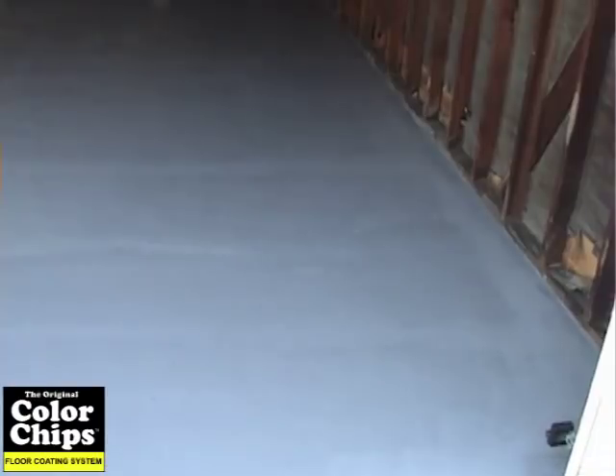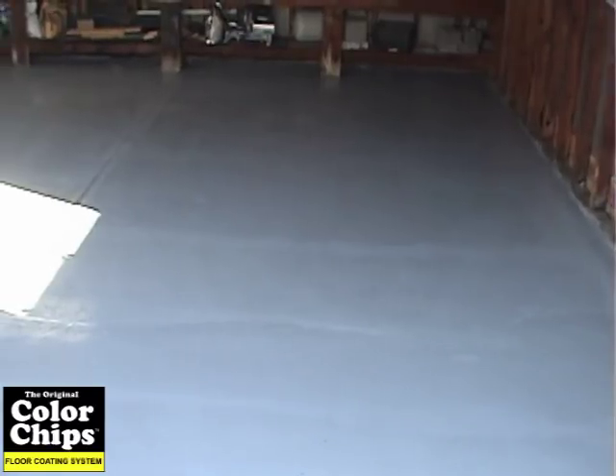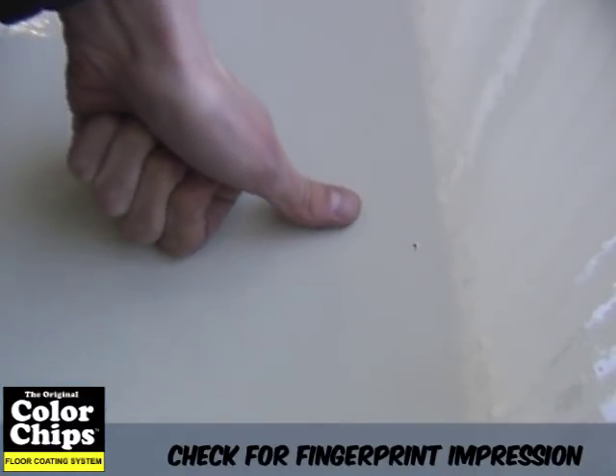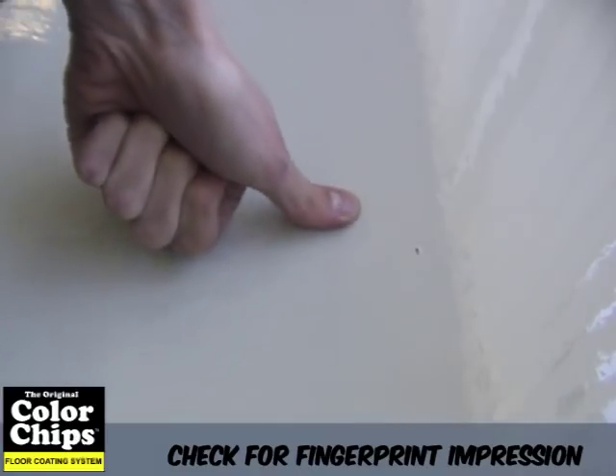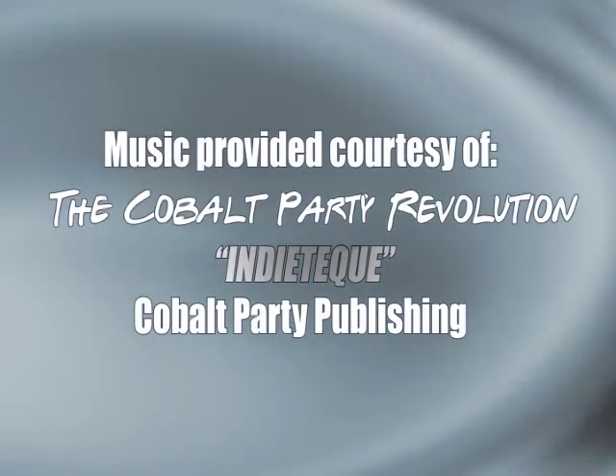After applying the primer coat, you may notice blotchiness. This is normal as the coating soaks into the substrate at varying thickness. You must be sure that all of the water or solvents have evaporated from the previous coat before applying your next coat. You can test this by pressing on the coating with your thumb to verify that no fingerprint impression is left. If no impression is created, then the re-coat or top coat can be started.